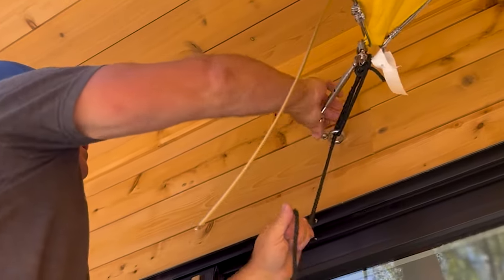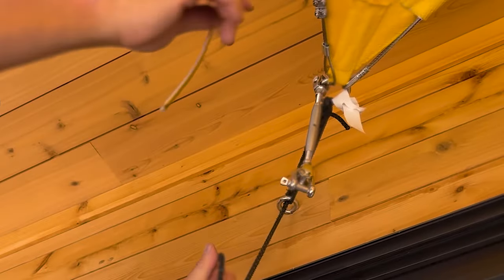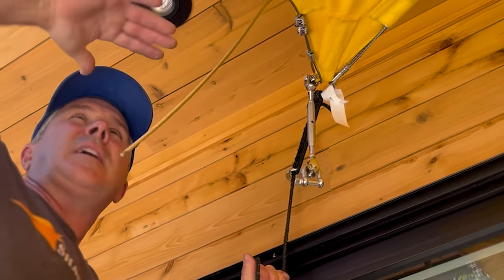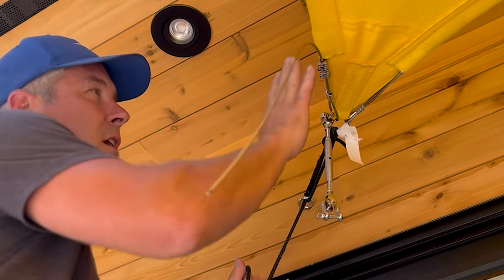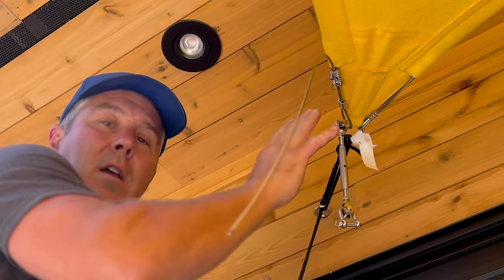With the use of a pulley I could easily connect this. Again, cable clamps are all loose all the way around so that we can go around and tighten these after we have cables in the edge of our sails, because it allows the shape to be much more rigid and the sail to hold its shape and not stretch. That's why we go to the trouble of getting these cables. Watch the detailed videos on how to tighten these.